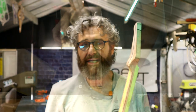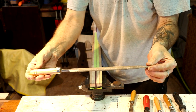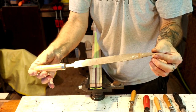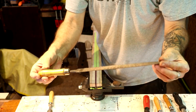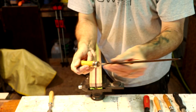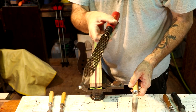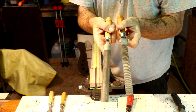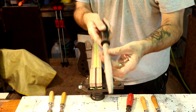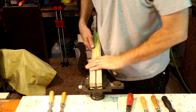I've got some tools out — a few new things actually. A tapered end Nicholson vintage double-zero cut file right here. I also got a Nicholson hand-stitched rasp, number 10 cut — this thing feels like a cat's tongue or shark skin. Then my standard stuff: the Shinto saw rasp, two Iwasakis for the initial part of the neck carve — a half-round medium cut and a flat medium cut — and my little hand-stitch rasp from Lee Valley Tools. Let's get rolling on this neck shaping.